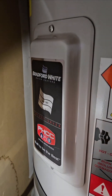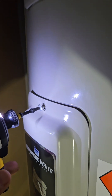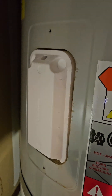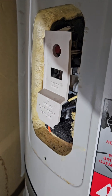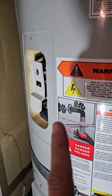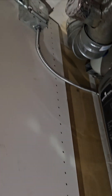This panel can be easily removed using a hex screwdriver. I've taken the bottom panel off already. Now take out the top side here — this comes right off. Don't lose that screw. Set that down and then you have this insulation panel, which also comes off. Absolutely, before you do any of this, make sure and double-sure that the power is off at the circuit breaker. This unit also has a dedicated circuit switch which is also in the off position.